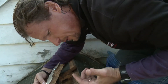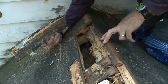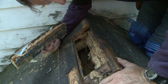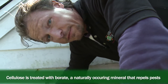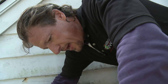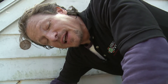One thing that we see here in opening up this roof is that this foam insulation was eaten by bees. And the bees came in here and they tunnel in this foam, and you can see all the dust that they make. And the homeowner has been complaining of dust falling through the ceiling in places — in fact, piles of it on the mantelpiece. So we know that there is plenty of space for air to leak out. And the thing about cellulose is that it's treated with borate, which is a safe chemical that's mined from the ground. It prevents mold from growing on the recycled newspaper — that's what cellulose is. And it prevents bugs from getting in there. The bugs do not like borate. It keeps bugs away, so this will stop the bees from coming in there and also stop the air leakage. And borate, in fact, is very, very safe — it's an additive in eye wash, that's how safe it is.